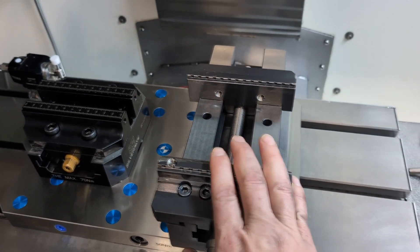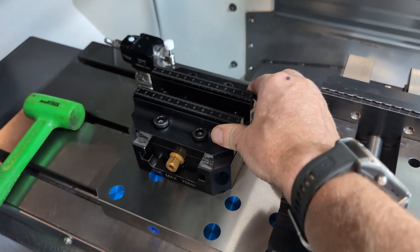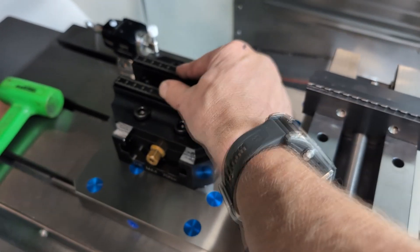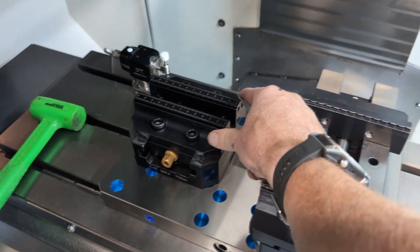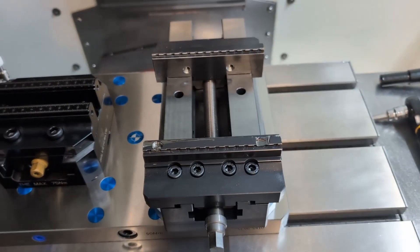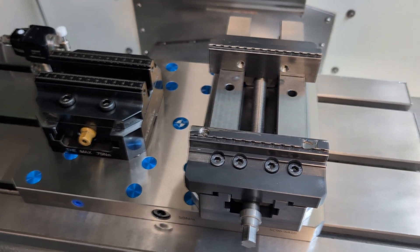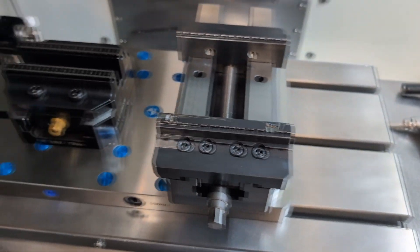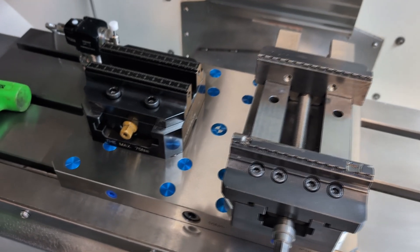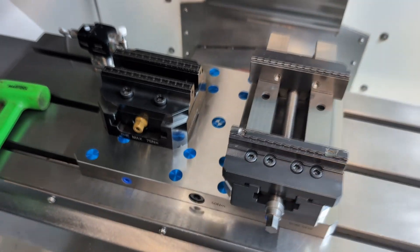It's definitely not like this other vice, which has a fixed jaw — this one doesn't have a fixed jaw as such. There's no offsetting parts; even a slightly offset part is going to lead to racking. I know you're not supposed to rack a vice, but some of my jobs do require a little bit of an offset, which this M-Lock does a lot better with. I've got a couple of other more heavy-duty devices for offset work as well.